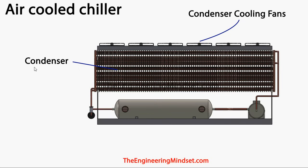This part here is known as the condenser. The hot refrigerant coming from the compressor will pass through the tubes within this condenser — you'll see there are a number of loops. It will pass through here and make its way out into this header. By the time it leaves the condenser, the refrigerant will be a high pressure, medium temperature, saturated liquid.